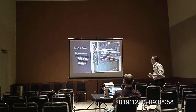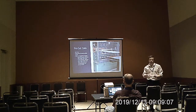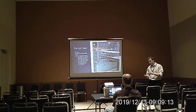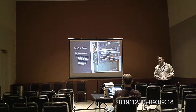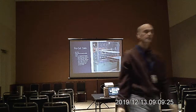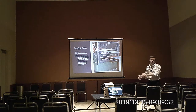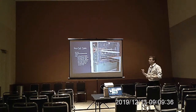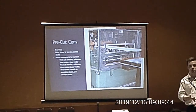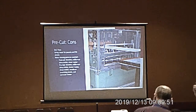The second con is that using your shear for both panels and flat sheets can become a problem. Whenever the combined time needed to run your panels, flat sheets, and slits is more than eight hours, you'll have to either add a shift, increase lead time, or buy a separate slit cut-to-length line. Once you have enough jobs to justify separating panels from your slit line, it's worthwhile — but until then, it's a headache you'll have to manage regardless.